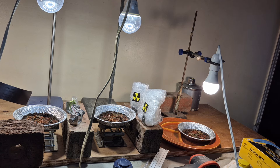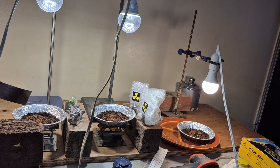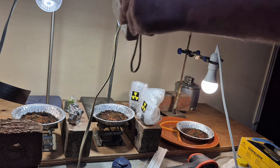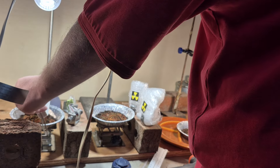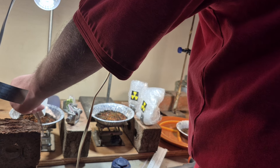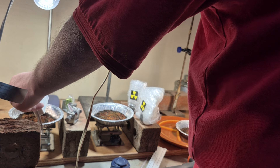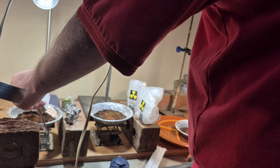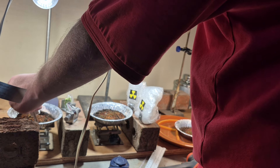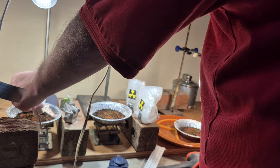I have this radiation meter and I'm going to test just a little bit to show you the reading in between these two samples, because they're the most potent radioactive samples I have. We set it for a minute and record the radiation. At 20 seconds it's already at 155 counts per minute, 1 microsievert. At 39-40 seconds it's at 1.75 microsieverts per hour — pretty potent.